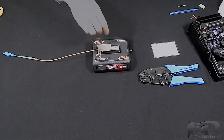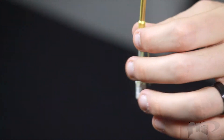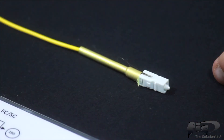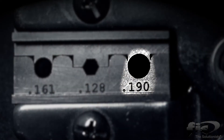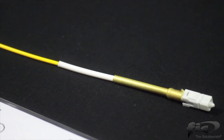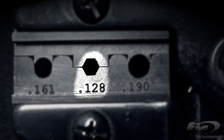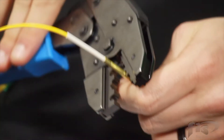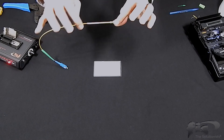Once the light stops blinking, the oven has finished the melting process. Gently lift up the jacket and allow the splice to hang. Slide down the brass sleeve over the shrink tube. Refer to the crimp chart. Since we are terminating an SC connector, we will be crimping the front of the brass sleeve with the 190 hole on the crimp tool. Crimp the front of the sleeve as shown. Next, slide the furcation tubing all the way down. The splice inside of the brass sleeve will prevent it from going any further. Once in place, refer to the crimp chart. For the back of the brass sleeve, we will be crimping with the 128 hole on the crimp die. The brass sleeve is now in place, protecting the splice inside and securing the connector to the Kevlar.